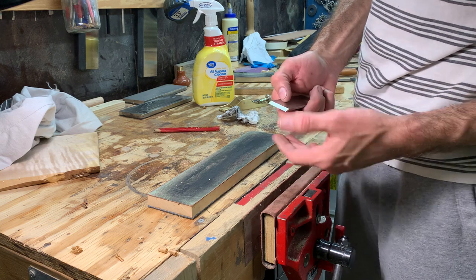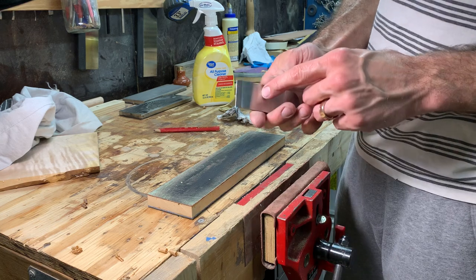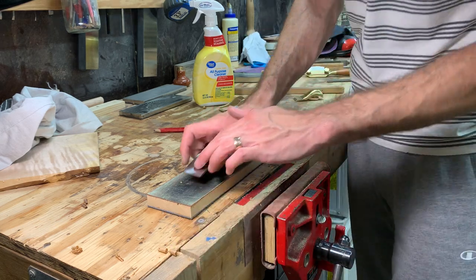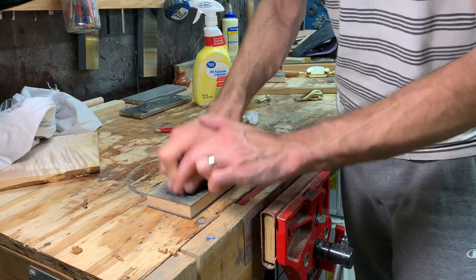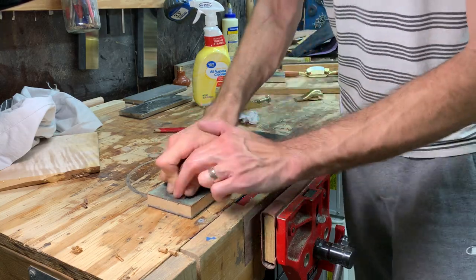This is 3 micron, so this is about the equivalent of a 6,000 grit water stone — that should be a cutting edge right there. Down on my registration point here — this is just leather rough side up on a piece of MDF glued down with green honing compound. I don't think I've ever had to handle a blade quite that thin and small before.